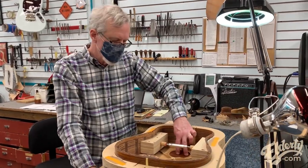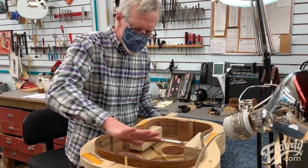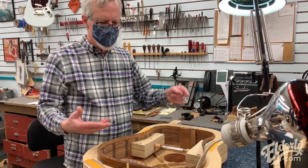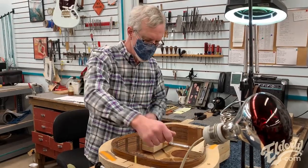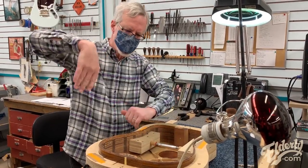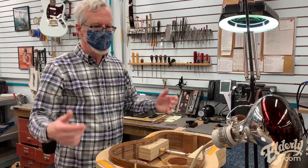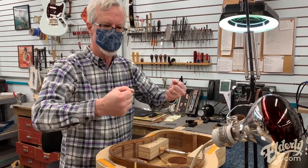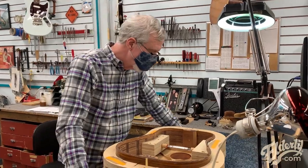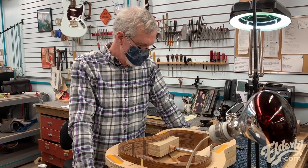I mentioned before that I have a work board underneath there. You can see the mahogany through the sound hole. This work board has a flat edge and a flat upper bout. It transitions to like a 30-foot radius here in the lower bout in this area. And so when I make the new braces to put in here, they are also going to be final sanded on this work board, to take that shape. And then when I glue them on, the brace will have that shape, the work board will have that shape, and I will glue the brace down there, and hopefully then the top will retain that shape. And then with string tension, you'll also get an extra helper there in retaining that shape or creating a slightly new, different shape, which is my version of what a 30 style top should be, what the dome should be. And that's where I'm going.